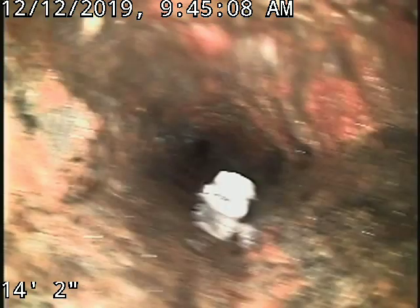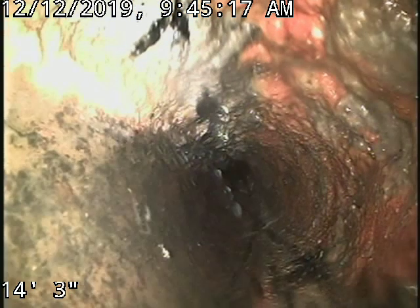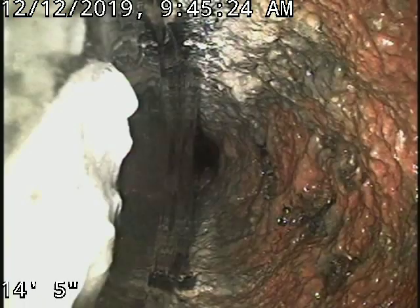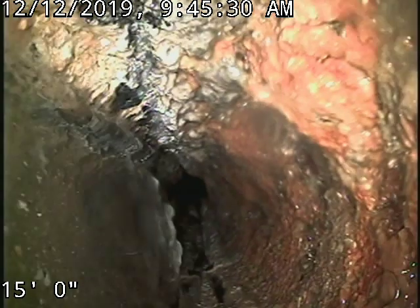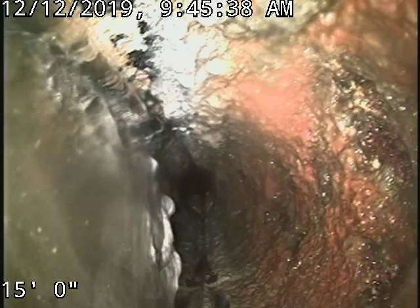From about 12 to 18 foot you can see how toilet paper will sit in there. There's paper right there just sitting in there, and that will cause a chain reaction. That piece of paper sits in there, then another piece gets flushed and sits in there, and so on and so on until the line backs up.